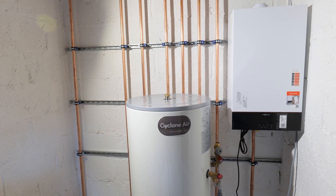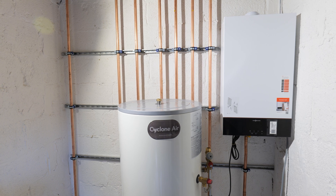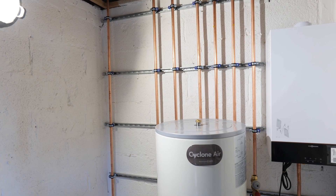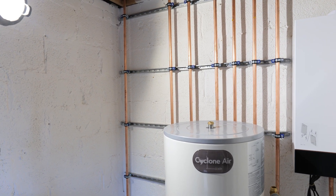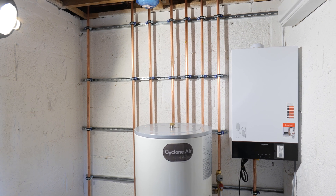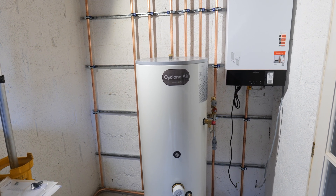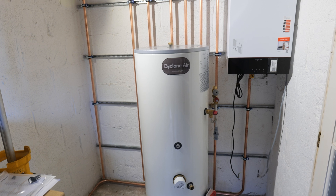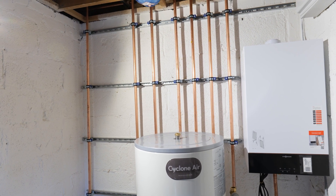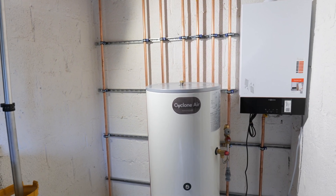Let's just give you a quick overview of the job. This is a four-bed detached house and we are currently installing a plant room as part of a full plumbing and heating installation. The customer has kindly stripped back the wall in the utility room, painted it all white, and as you can see we've already made a start getting pipework on the wall. We acquired this job because we did the neighbours' four or five years ago and they kindly recommended us. Although the houses are a complete mirror image, we're not going to be installing the plumbing and heating in the loft like we did at the neighbours'. I did film that job so I'll put a link at the end of this video, but in all honesty I wouldn't recommend putting all this equipment up in your loft — you never know if you're going to get a leak from any of the components and it could potentially cause a lot of damage. So we advised the customer to put it all in the utility room on the ground floor.